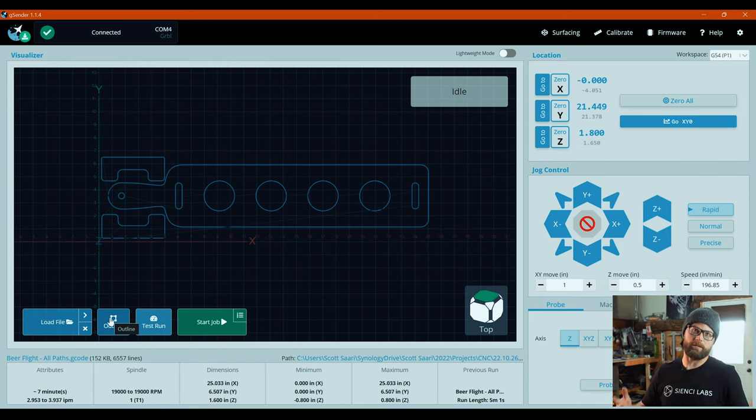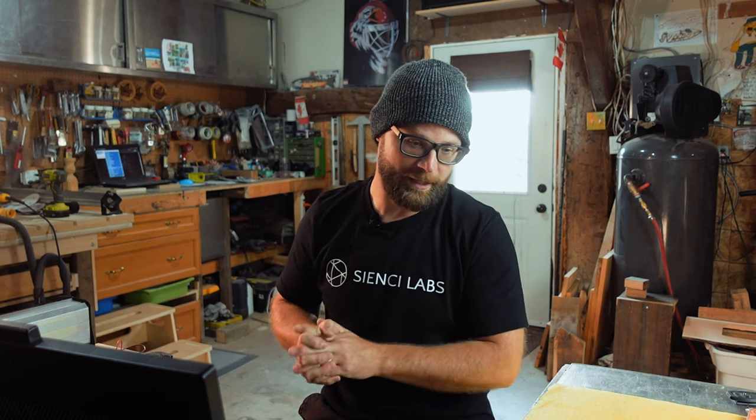I also make sure that I hit that outline button in Gsender because I wasn't paying attention because Louis was here distracting me when we were filming, and I didn't zero out my X and my Y, so it started going off and outlining somewhere different. I went, aha, learning moment. So we reset it and we were off and running. So make sure you hit that outline button to check. It will also give you a good indication if you're using a dust shoe, whether or not it's going to bump into your clamps, which can also cause trouble.